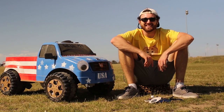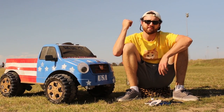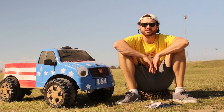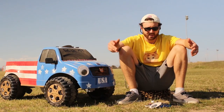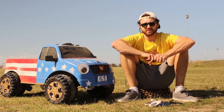It works better than the first one. Still got some issues though. Special thanks to Oscar for the O-Drive. It's an alpha board. If you're a developer willing to deal with some quirks and bugs of a brushless servo driver, you should go check it out. It should be consumer ready in some months. It's really awesome if you want high torque at zero speed or very accurate controls for a CNC.